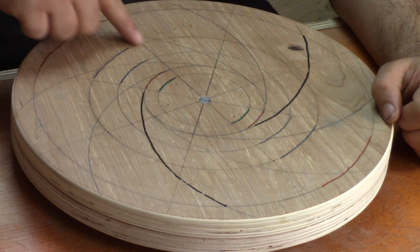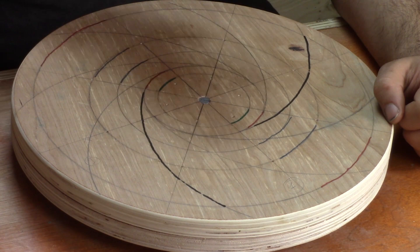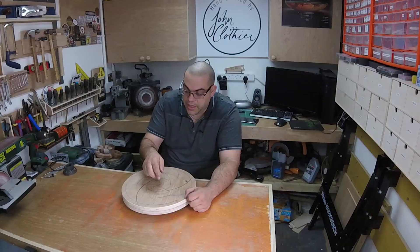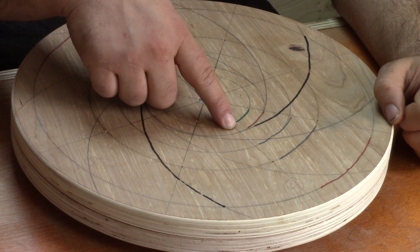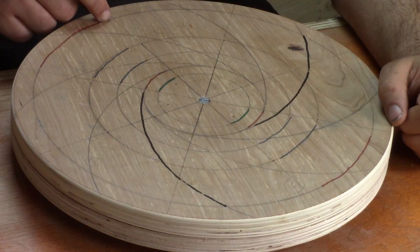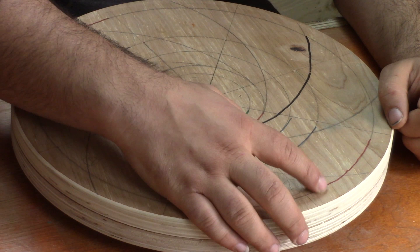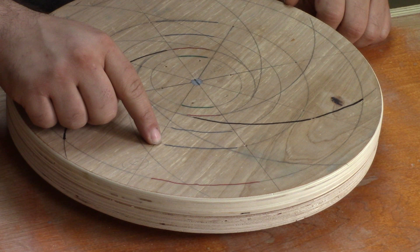Having got that, the next thing I needed to do was draw another circle — this is going to be the inner side. You need to make sure you leave enough distance between this hole and the faceplate; I've gone for about half an inch. You then need to go to the outside edge and draw another circle — this time I've gone for about three quarters of an inch. So that's the two red lines here. The next two, which are these blue lines, are a little bit more complex. This blue line is halfway between the two red lines, and this other blue line is halfway between that blue line and the outer red line.